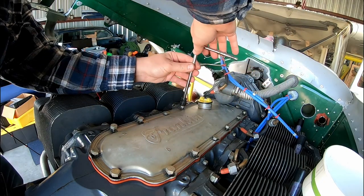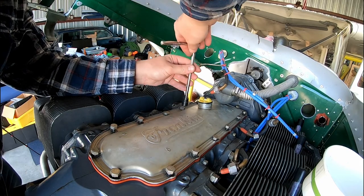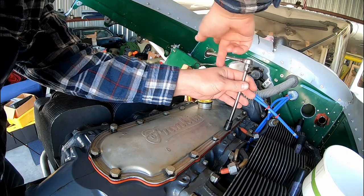So the key with the reel gaskets, especially on these larger panels, is to make sure that you're torquing them down evenly. I use a pattern, I cross back and forth across the whole panel. Make sure they're all started before you start locking them down. And the big thing with these silicone gaskets is not to over tighten them. I think the recommended torque is 25 inch pounds. That's like barely finger tight. What happens when you over torque them is that the gasket will start to squeeze and it starts opening up gaps on either side of that fastener. So just very gently with the reel gaskets.